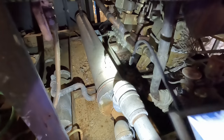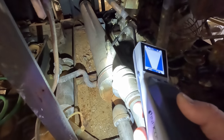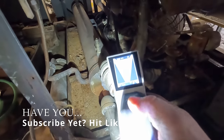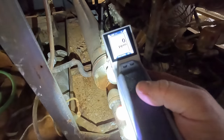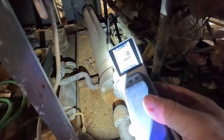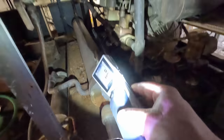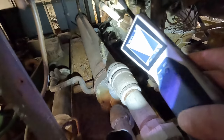I did find some oil up here and found some leaking on the valve there that had popped off. Possibly that had blown off earlier this year when the pressure switch failed to shut it down. On super position, if I go to parts per million, that usually tells me if it's just an accumulation of something. It went up to about 15 a little bit ago. Now the unit is off and there was something in there, so when it's running with a couple hundred pounds of pressure I'd be curious to see how bad it's leaking.